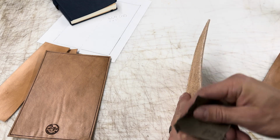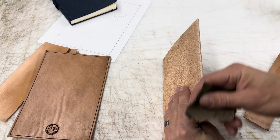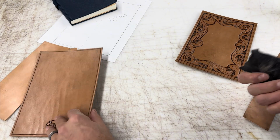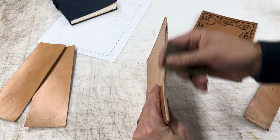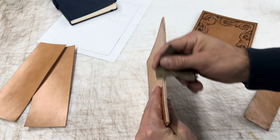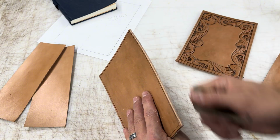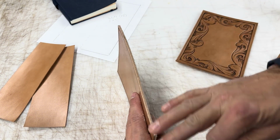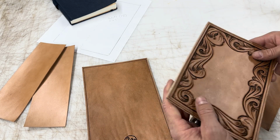We talked about that a little bit on last month's project as well. It just comes down to how much prep you want to put into those edges. And you can even, like this is a 320 grit here on my sandpaper, and you can just keep sizing down on your grits. Well, I guess you'd be going up with your grits, so it gets to be finer sandpaper. And really get this feeling super smooth before you even start with anything else. And then the rest of your steps go really easy.